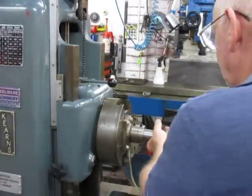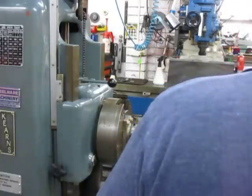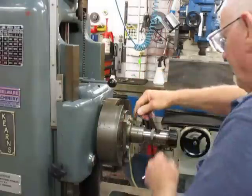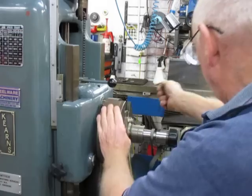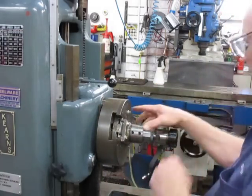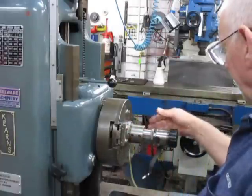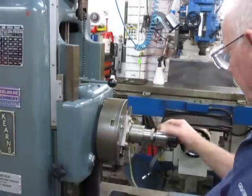So that will then fit in here, and I'll lock that in place. What I've also done is I've set the key lock. There's a key lock here. It's a wedge that wedges and locks the slide into zero point. So I've run the dial in, and I've dialed that down to be 100%.